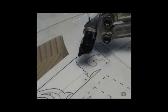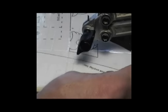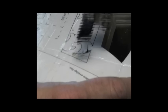And I'm actually going to go down to the V, cut out an area where I can begin here in a minute, and then I'm going to back the blade up into the original hole. Reverse direction, and then reverse the blade back down into the line all the way to the V, and take off and cut off the waste areas. As you come to those areas, slow down and take it easy so that you don't actually cut into the wing. Once they're clear, we'll continue from the V and cut out the rest of this inside cut.